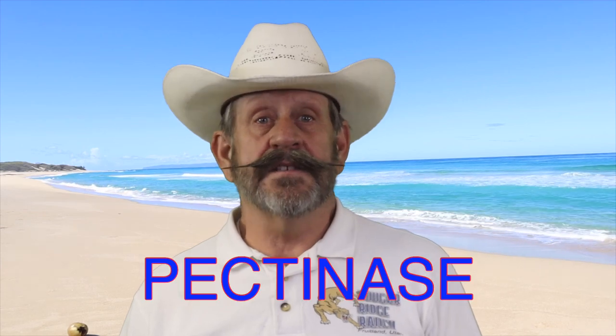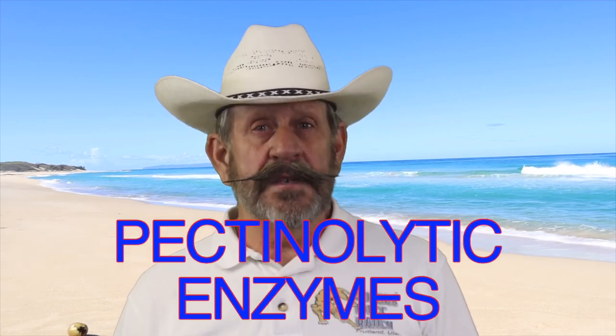Okay, you've probably got some tomatoes in the bottom of your fridge that are going moldy and rotten, right? Yeah, we did too. Don't throw them away. They actually contain the exact enzymes that the good bacteria in your septic tank make. These enzymes are what you would normally buy in the store in these $15 or more bottles that you pour down the toilet to juice up your septic system. The enzymes that rotten tomatoes contain are called pectinase. They're known as pectinolytic enzymes, which are a group of enzymes that hydrolyze or liquefy pectic substances. You can look up pectinolytic enzymes, I'll put the name in the description, but suffice it to say they help break down and liquefy the solid matter.